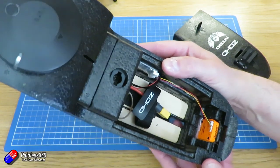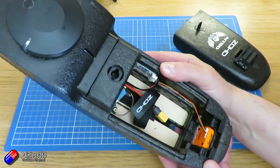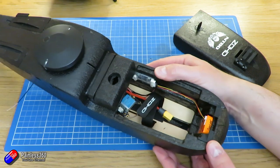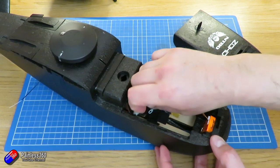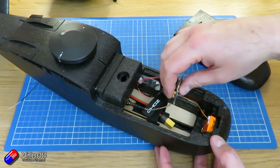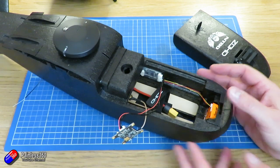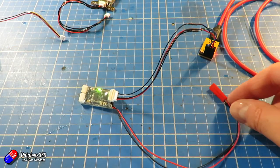Hopefully that's interesting for those of you who want to do this. My recommendation these days: don't mess around with Minim OSDs from eBay and try to source all the cables and do all the messing about. If you want the default layout, this is a plug-and-play option for Pixhawk. And if you get your hands on an FTDI adapter, you can download the software for your PC, plug the FTDI adapter in, and configure it to work in the way that you want.